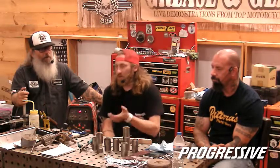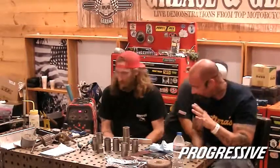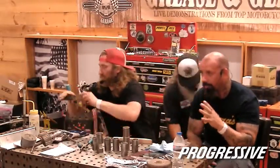Sometimes they say stainless, you should weld at 10 to 15% less because it doesn't take as much heat. You don't want to introduce that heat into the part for corrosion. Yeah, and if you do longer welds, again, that heat buildup causes the problem.